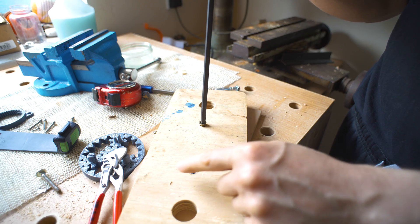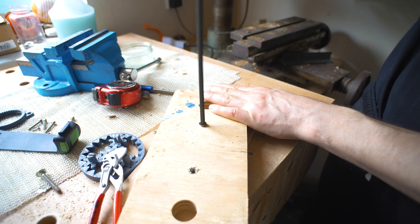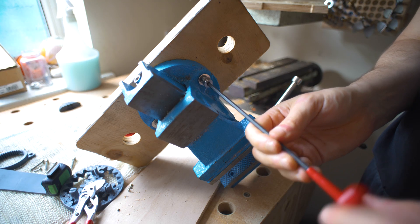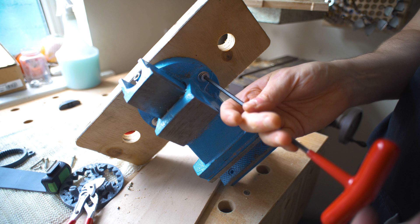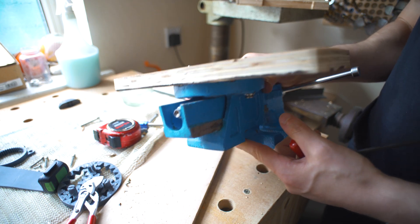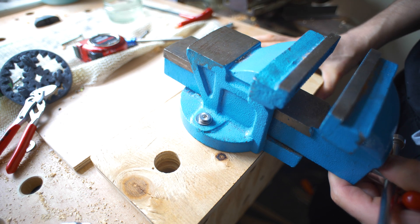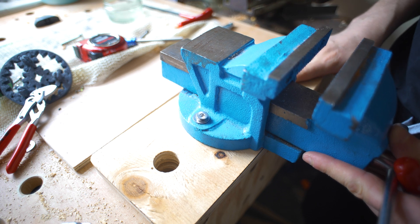I messed up one hole — drilled the wrong size. For the M6 threaded insert it recommends 8 to 9mm, so I've gone with a 7.5mm drill bit because this is pretty soft plywood and 7.5mm seems to work. I'll just put some masking tape and flood it with wood glue to make it more stable. I never have the right size screws for any project — I've got a countersunk bit and two washers to spread the load, but the screw is also the wrong length and protrudes out, so I'll have to cut the ends off. Let's do a quick test of lining this up — the bolts go through, and now all we need to do is get these clamps on and that should hopefully be it.